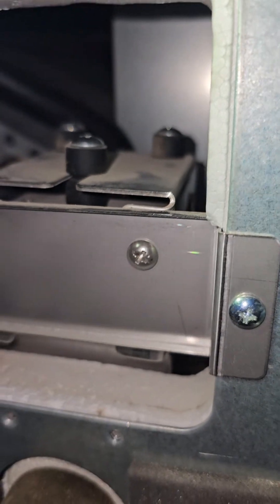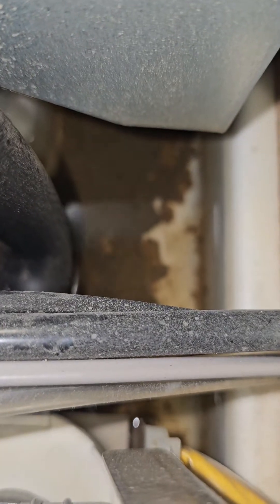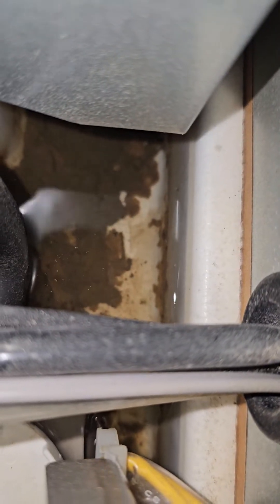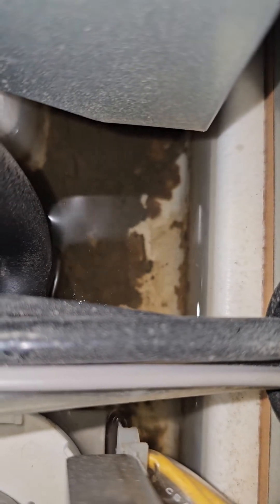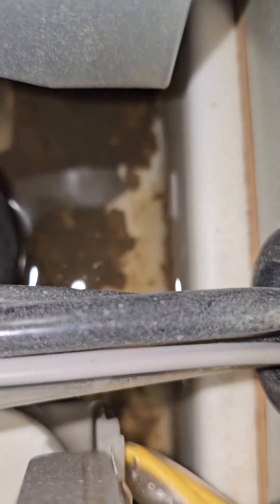In this case the fuse is fine because I can feel that the pump motor is warm. Let me stick my hand in there to check the water level. That looks like a lot of water — definitely this pump is not pumping out.